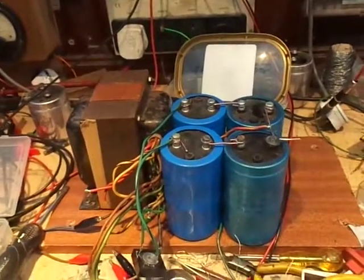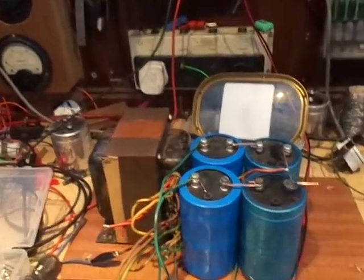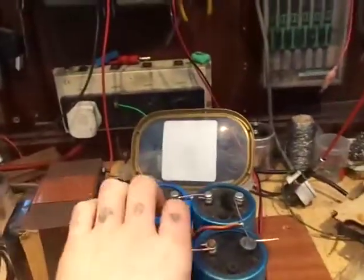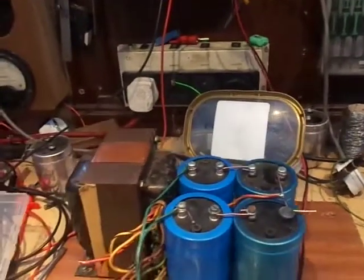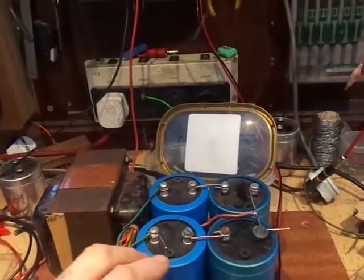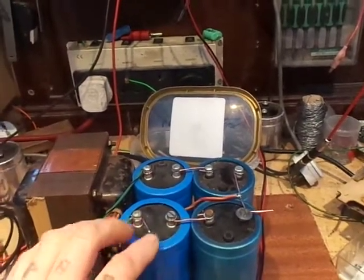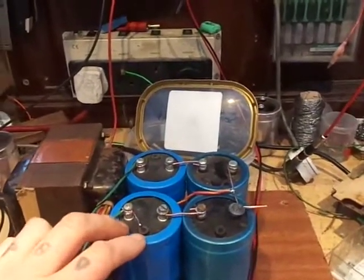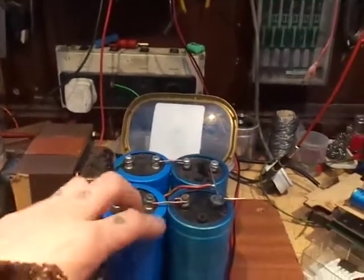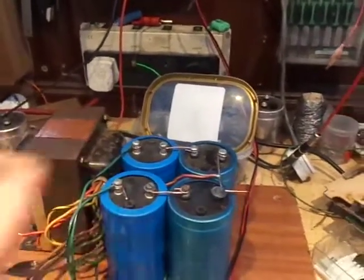Following morning — and we're trying out a new lapel microphone I found, hopefully to improve the sound and get rid of some of the plosives. We're getting on: the capacitors are wired up. We're putting two of these big capacitors in series because they're only rated for 40 volts and we're looking at 56 volts. They'd probably take it but I've had capacitors blow up before, so yeah, they're in series. Each one of these capacitors is 33,000 microfarads, so halved, that gives us about 15,000 microfarads.